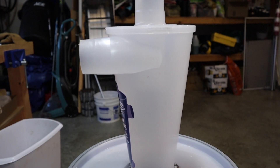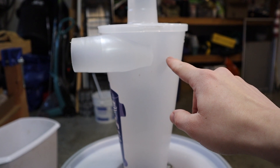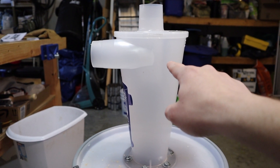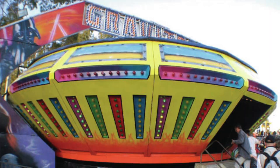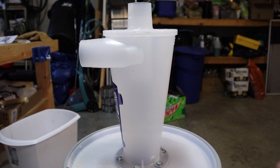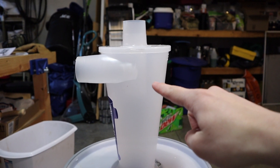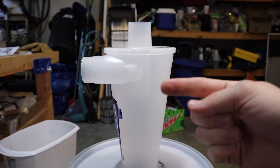Everything in that airstream has a different mass, but just like when you're in your car going around a corner really fast, the dust and debris has nowhere to go except to follow the cyclone all the way around. From the top it comes in and can only go around, and because of the inertia of all the particles they trap themselves against the wall and can't come off. Like those spinning fairground rides where you get stuck to the wall, the dust feels a centrifugal force pushing it outward, while it is the centripetal force supplied by the cone wall that actually keeps it there — these are the force balances at play.